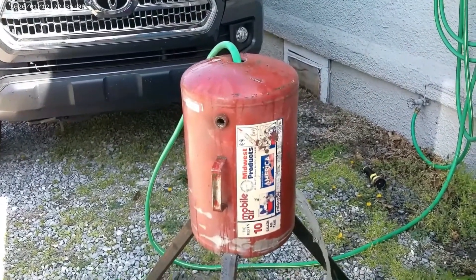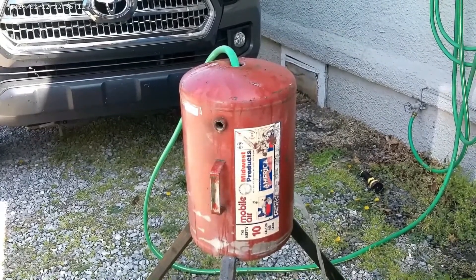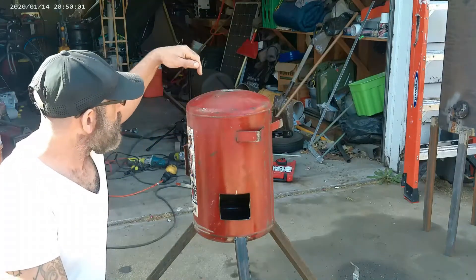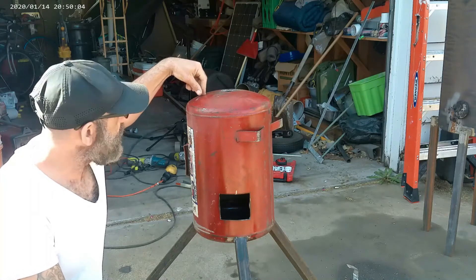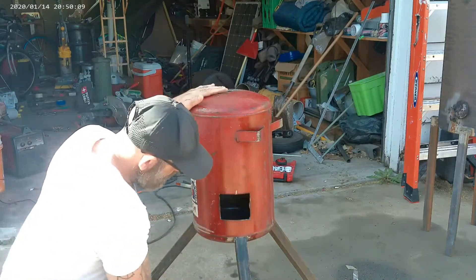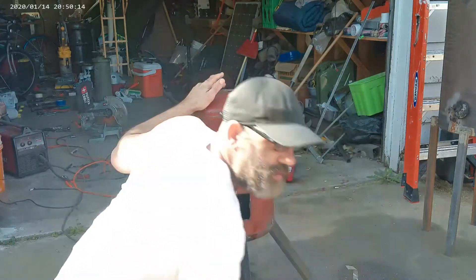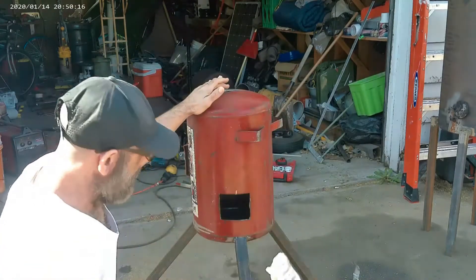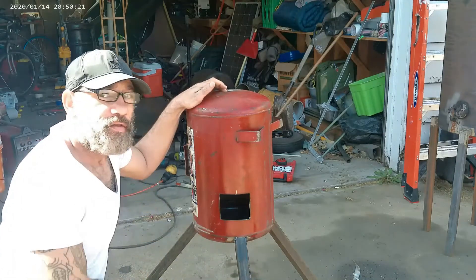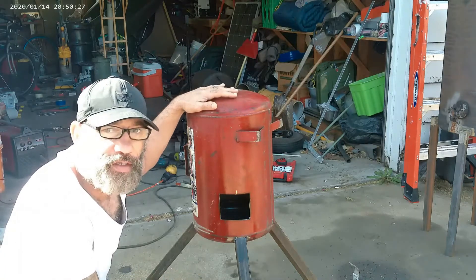Lessons come in all shapes and sizes. Now that we've got this tank flushed out, we need to put another hole in here for the other three-quarter inch gas line that's going to run over to the other condenser. We need to flip this tank upside down, put a hole in the center at the bottom, and weld a three-quarter inch gas line in the bottom so we can put a valve on it to drain the fuel out of this tank.